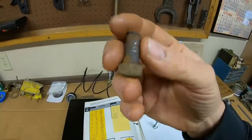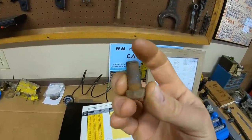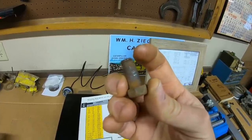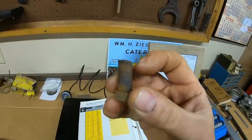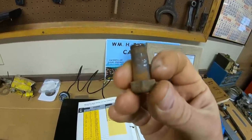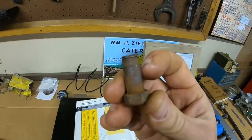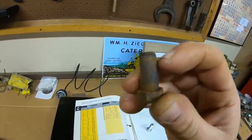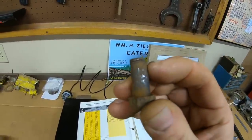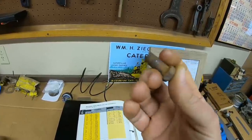To contrast, here is a torched-off original track bolt that I took out of one of the links. I'll torch the nut off and let the lock washer be the sacrificial barrier so I don't bite into the link. You can see the grip length on the original bolts gets you through the hole in the track pad and 90% of the way through the hole in the link. Then the lock washer basically occupies the area where the threads begin, so your nut has good threads all the way down.